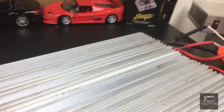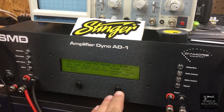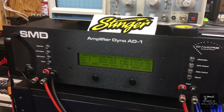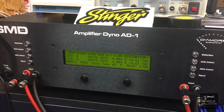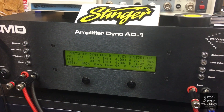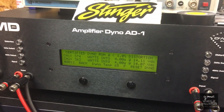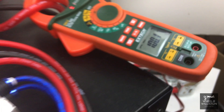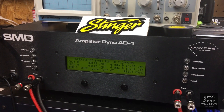Here's the Eclipse 34230. Doing the test at 4 ohms stereo — this is a stereo amp — at one kilohertz. Right at rated: 374, 363, right at 14.1 volts, and we pulled right at 100 amps. It has 100 amps of fusing, so it's right at what it's supposed to do. All right, we're going 4 ohms uncertified at one kilohertz.